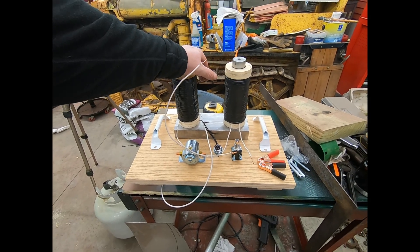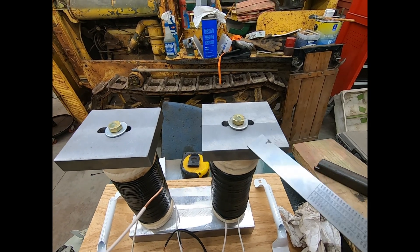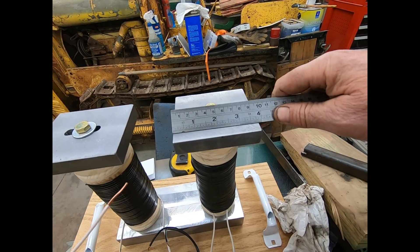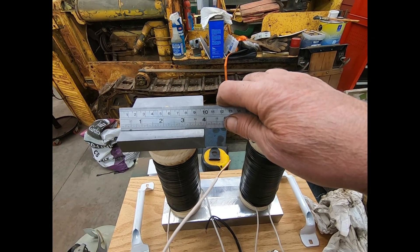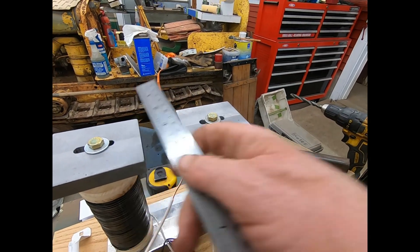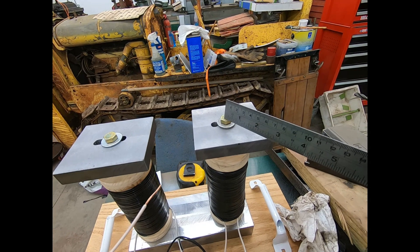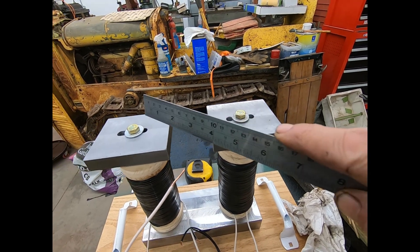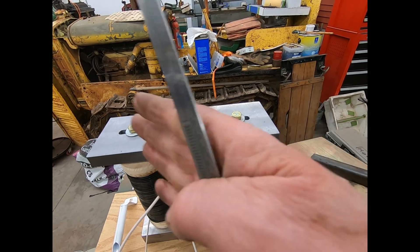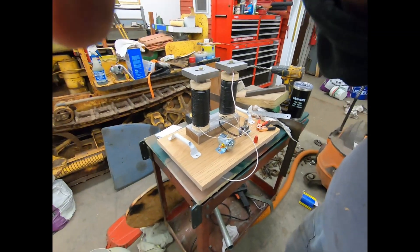Things are coming along. I'll show you these pole pieces that go on top once I get them cut and machined. I got the pole pieces done. For somebody that wants to build one: that one's three and seven-eighths, that one's three and seven-eighths, and they're three and a quarter wide, three-quarter inch thick. I've got three holes in here - one straight, one at 0.625, and one at one and a quarter. It's got a stop-and-hold but I milled it between, so it's infinite in its adjustment.